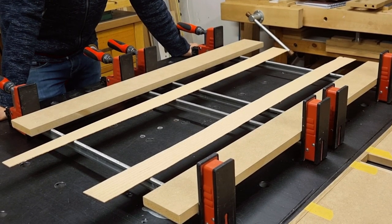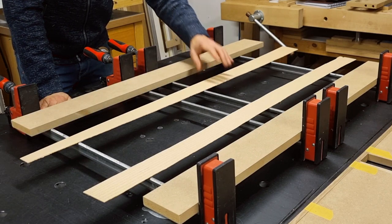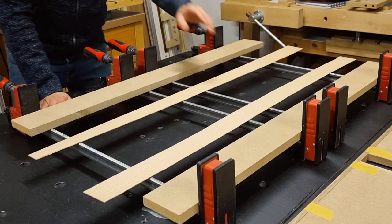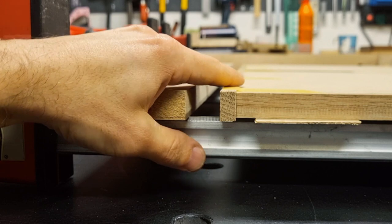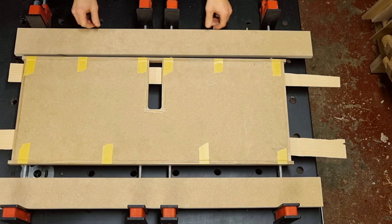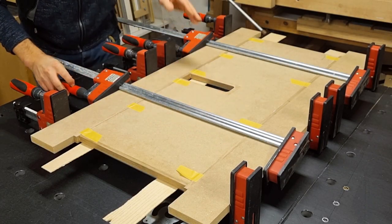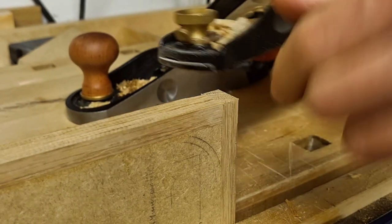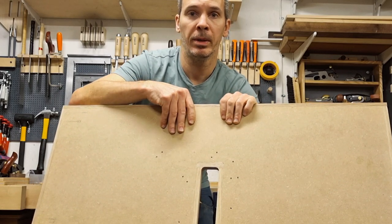It's time to put the longer edge banding glue-up in the clamps. For longer pieces where it can be hard to control the edge banding in the up-and-down direction, I use shims under my base surface about 1 millimeter thick — as thick as I want the edge banding to protrude. This keeps a constant distance from the edge banding down to the base material, especially if the edge banding is slightly warped, so I can put pressure on both parts while tightening the clamps. I also use clamping cauls on both sides to spread the clamping pressure. When the glue has dried I trim the edge bandings flush with the base material and trim the corners flush with the outer surfaces. I remove the protruding material where my screws were, and the part is finished as far as I can go without the laminate.